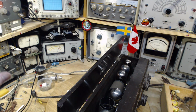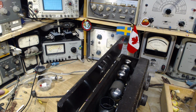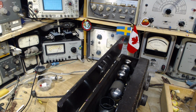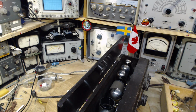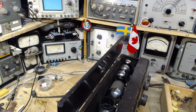The way I really control it is I leave this set to regular house voltage roughly, and initially, when I'm starting up a project, I run the power through these light bulbs. These are old incandescent style light bulbs. They're not LEDs by any means. The power before reaching the radio goes through those lights. If there's a big problem in the radio or the item I'm testing, like a short in it, then the worst thing that can happen is the lights come on full tilt. And it's pretty obvious at that point that something's going wrong.